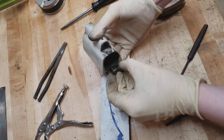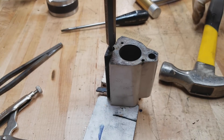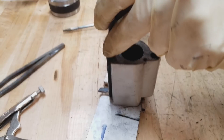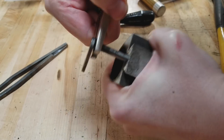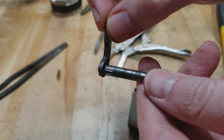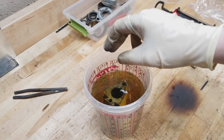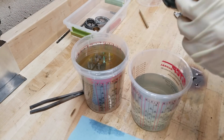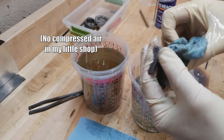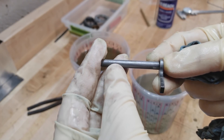There's an alignment indexing pawl used for finding vertical when you're grinding something. It should slide right out, but it's thoroughly seized. I tried tapping it from the back, but that hole doesn't seem to go all the way through. I gave up and used the vice grips to work it out. That piece is not in great condition and my vice-grips work didn't help either — the pawl itself is loose, so I may end up remaking it. We'll see if it cleans up. All the ferrous parts go into the evapo-rust, then rinse, dry, clean, and a light oiling. For blind holes where I can't get the water out, I'm using WD-40 for its on-label purpose: displacing water — and it works great for that. The alignment pawl actually came out really, really nice.